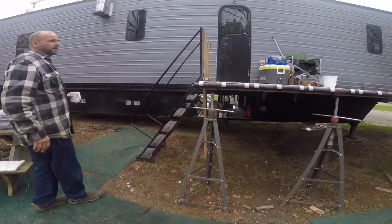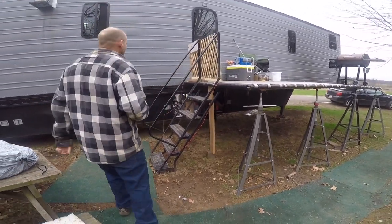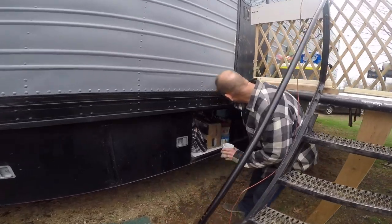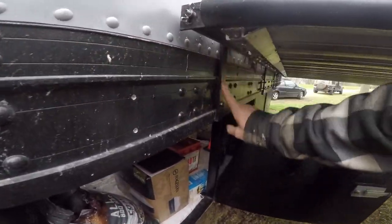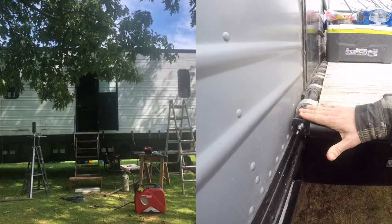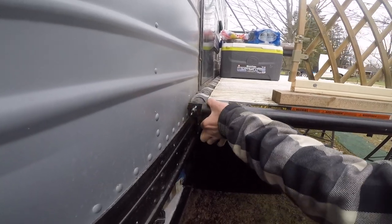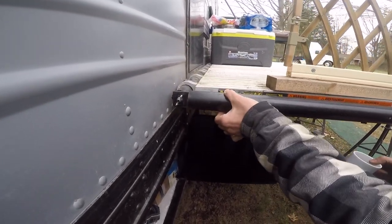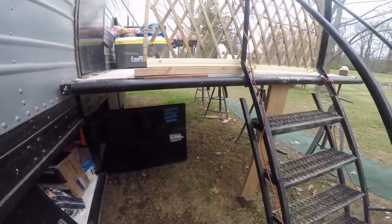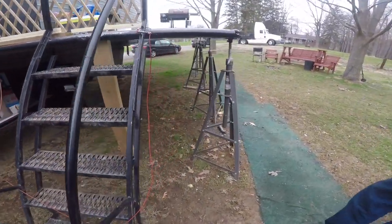This is not something you want to pull in for a week and just set up — maybe if you're going to be somewhere for a couple of weeks you'd want to put the deck together. Basically, what we did was some three-eighths by inch-and-a-half steel comes up and it's welded to a pipe, just so we could keep the same height as our door, and then these are just wing-nutted on here. This plate is drilled and spot-welded inside this tube, and then the wing nuts come off. It's just four bolts that hold the frame together, and then four of these two-ton stands.